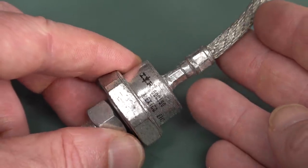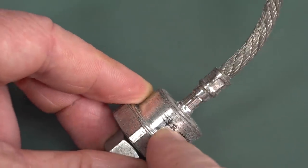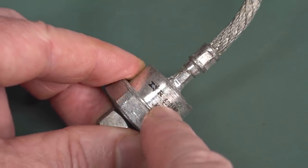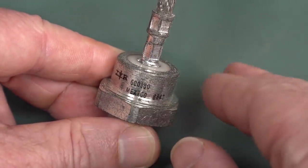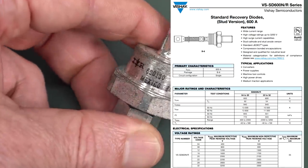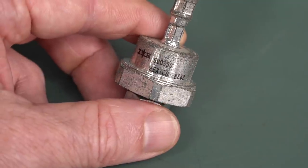And this is probably the closest example we've got to one that we can potentially know the specs for. Anyway, once again, International Rectifier, and it's got the diode symbol instead of the SCR symbol this time. But the reflections are terrible on this. You'll notice it's got 600, 150. And you can actually still buy these. This is like a DO-8 package, and date code 42 week 1988, made in Mexico.